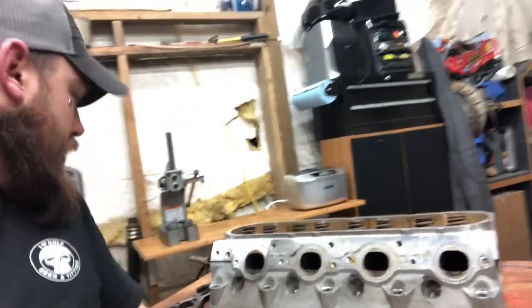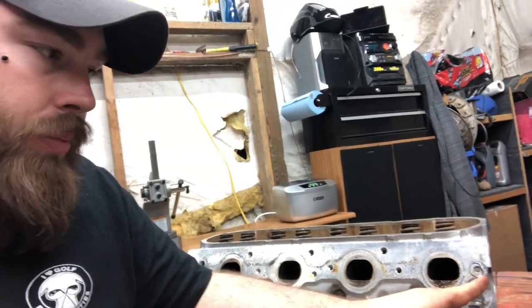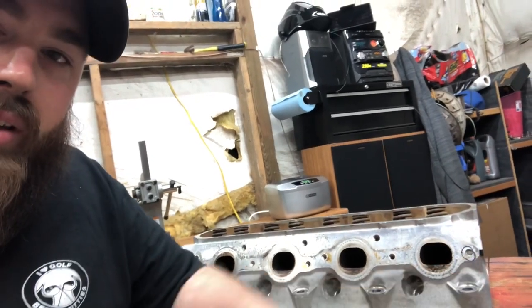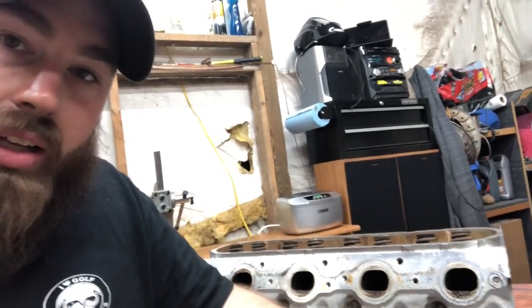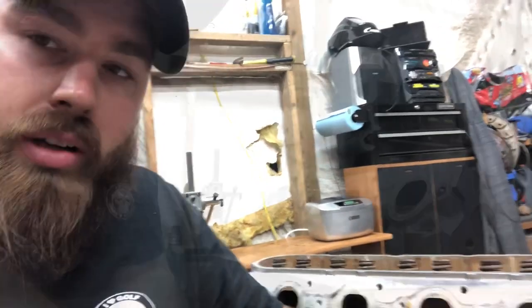What we're going to do is take a nut — I've got one laying back here. We're going to hold it onto the surface with a pair of pliers, and we're simply going to use a MIG welder and throw a weld right there on what's left of that bolt. It's not going to weld to aluminum. It's going to weld right to the inside of the nut and let us back it right out.